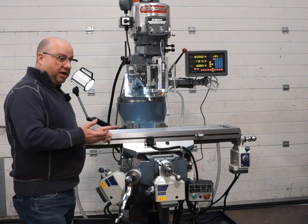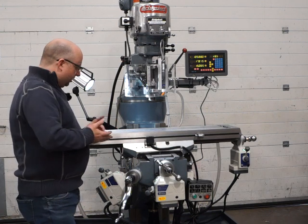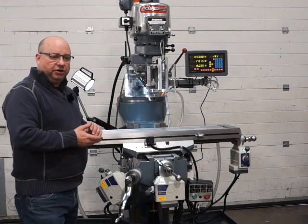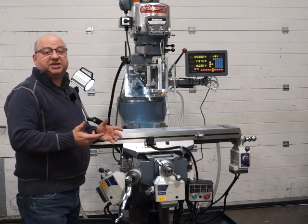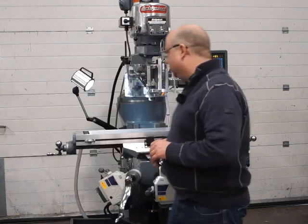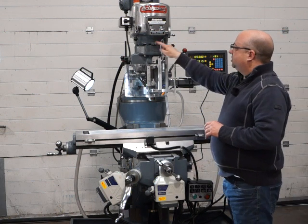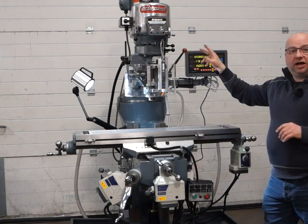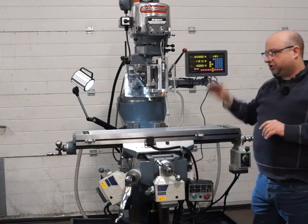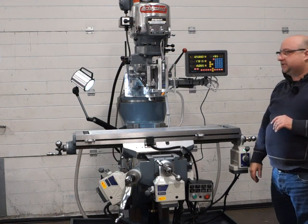And in case you need oil for it, it's BD68 lube oil. That's the stuff you need to put in there. And just give it a quick pump on the oil pump for about twice in an 8-hour period. It'll keep it running great for you, keep it in good condition. And the same with these little pots on the side here. There's two more for the head. BD68 in those as well, and the same for the drawbar. Just put a little bit down on the drawbar as well to keep everything lubed nicely.